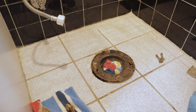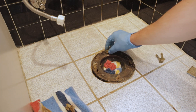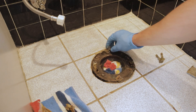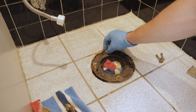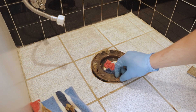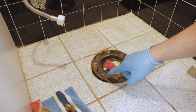We've gone ahead and cleaned up this flange. One thing I'm noticing right off the bat: this doesn't look like the greatest install. You can see these washers - they put washers on a couple of these bolts because the heads were too small. I can wiggle these bolts; there's almost a quarter inch of room between the top of the bolt head and these washers.